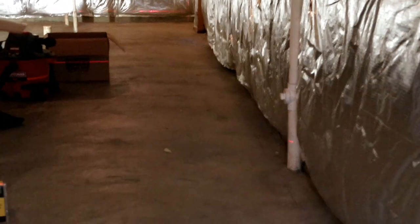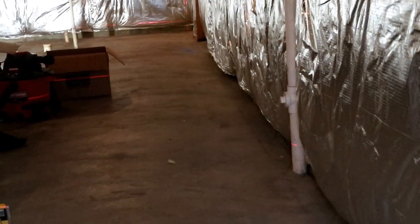This wall goes probably about 45 feet. In order to check that your laser is accurate all the way down, take a piece of scrap wood and drop it on your line somewhere down the wall. You can see the block of wood shows that the laser is directly on that line. Take it a little further down, set up your block of wood again — still on the line. Take it further still — still on your line. Now you can go back, get up on your ladder, do all your measurements, mark with your pencil all your spots up along the blocking, and you're good to go.